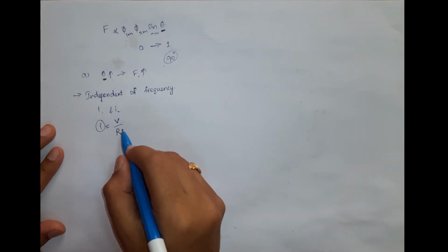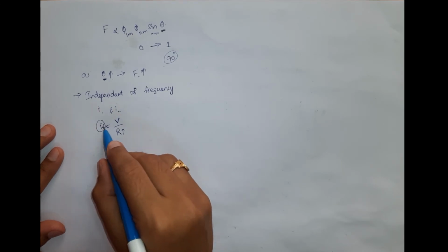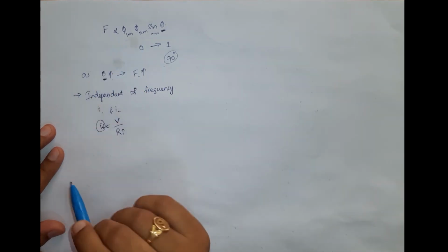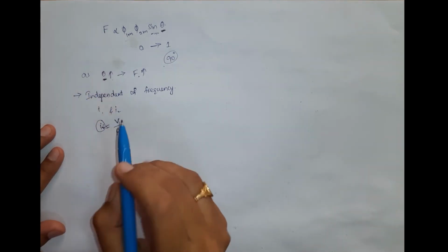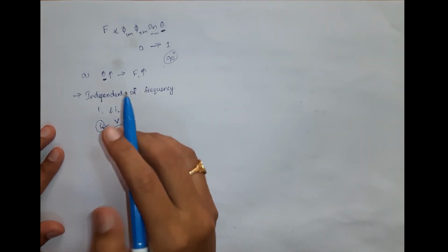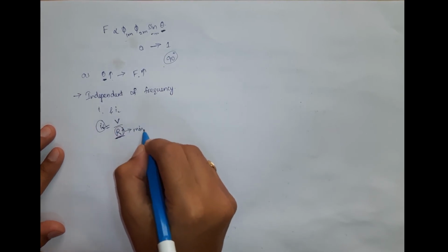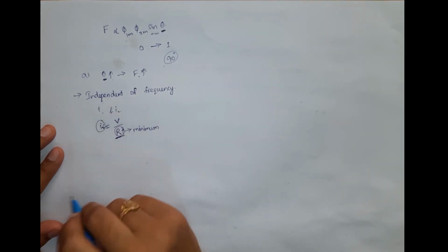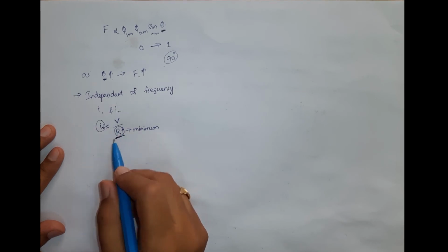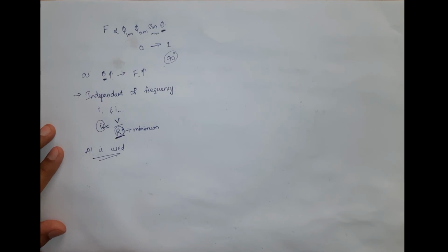If this resistance is increased, you know that the amount of current is decreased, right? If the current is decreased, phi1m and phi2m are also decreasing, which means the net force developed is also reducing. Indirectly, the resultant force depends upon the resistance of the non-magnetic material we are using. So for this force to be maximum, the resistance of the material must be minimum, so that more torque is produced. You have to choose the disc such that its resistance is minimum. Generally aluminium is used.